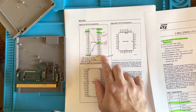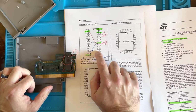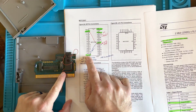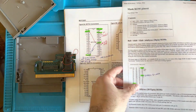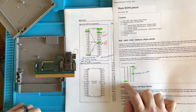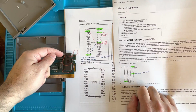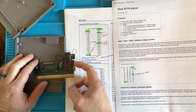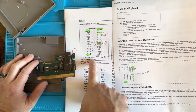So after doing all this research, this is what I have come up with. So we got the wires connected from this pin to this pin. So G is an output enable. VSS on this board is ground for Nintendo. I also had to get a Nintendo pin out as well to figure all this out. So this here is ground. And then we have a wire going from A16, which is up here, to the board. So this pin G, pin 24 here, is lifted, and this wire is attached to it, so it's getting ground to this pin G, which is the output enable on this chip.